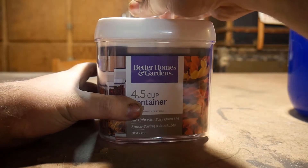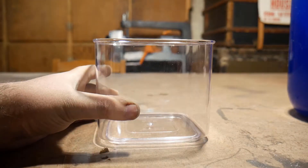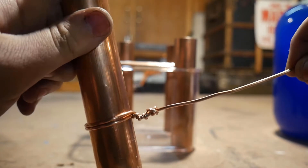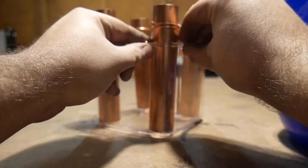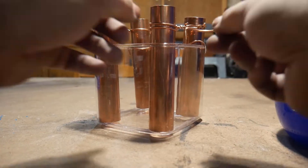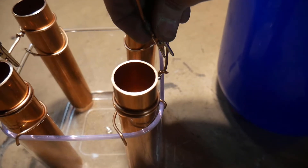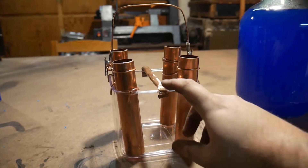Tank setup is a lot easier if we wait to put the solution in last. I've set up my tanks a few different ways and this is the most efficient. You're going to need four equal lengths of copper pipe and some 12 AWG wire. To make the first half of the anode, take two of the copper pipes and wrap 12 AWG wire around them very tightly — the pipe should not be able to slide through. Do this twice and your anode's done. I made some small clips to hold the pipes in place; we want them really sturdy. I connect both sets with alligator clips soldered onto wire so you can have all the electricity coming from one power source, making one very large anode.